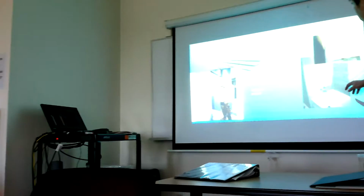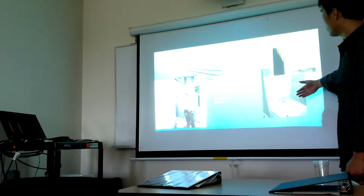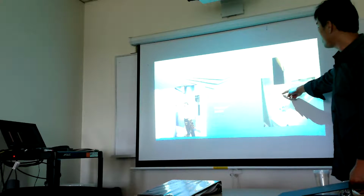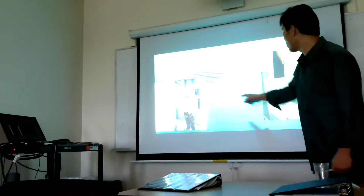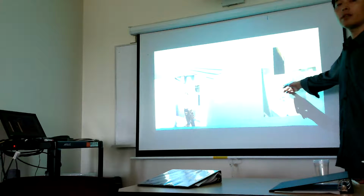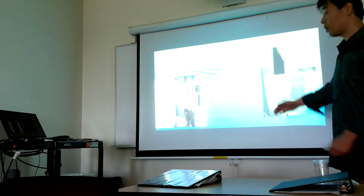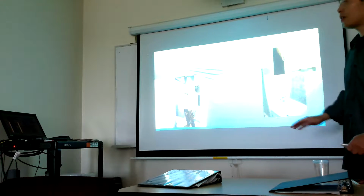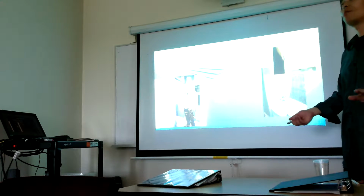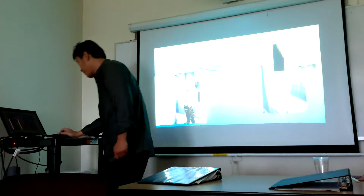If you need to work in the kitchen or the bathroom, you need to resist the water, so we need to put cement boards, not gypsum board here. It's much better for waterproofing, and it's much stronger. It's not only for the wall. You can put it on the floor. It's very strong. It doesn't matter if you put it on the floor and then pass a tire over it. It's good for this. It's waterproof.